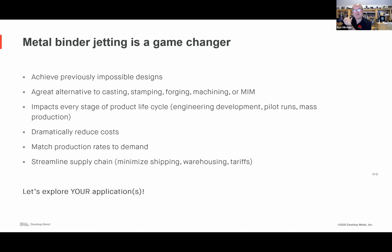More questions. What's the density you've achieved through the shop production systems? It's greater than 99%. We're shooting for even higher, but in practice, the voids are very fine voids, like 5 to 15 microns in size, and they're very nicely dispersed. In other words, you can have parts that can take pressure, that can take vacuum. There's not a continuous path through the voids, and so you get great material properties, and you can do vacuum testing, leak testing.